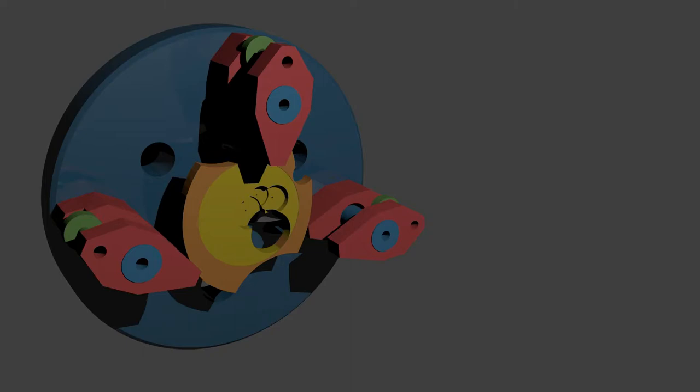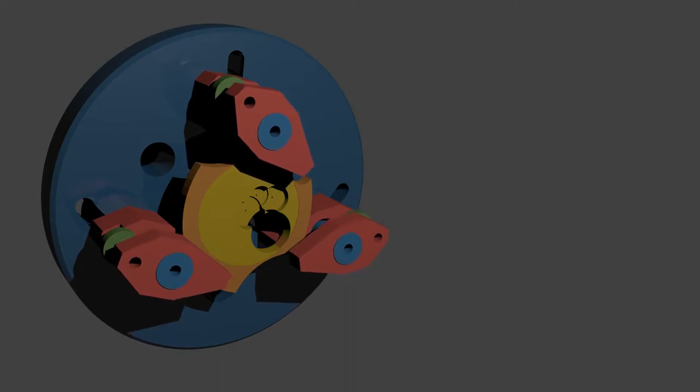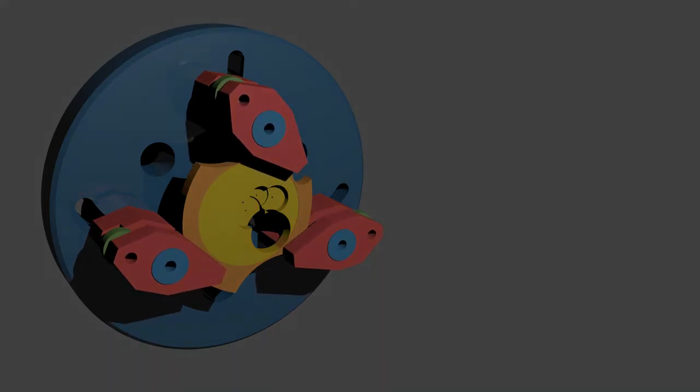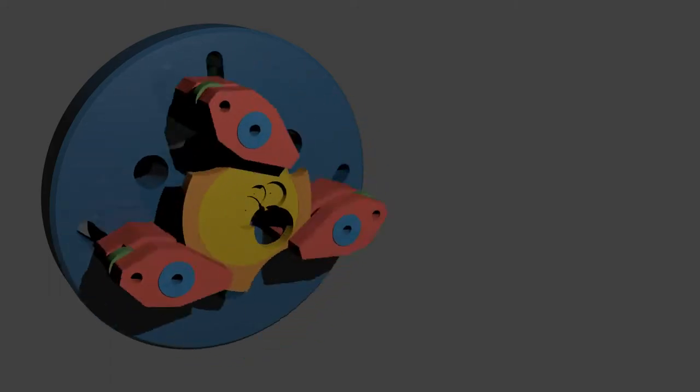The clamps are moved to suitable positions and then tightened to grasp the flanges firmly. With the part held firmly in three points, it can be turned on the lathe and the required features can be machined into the plate.